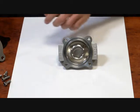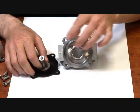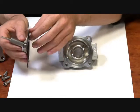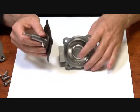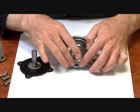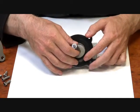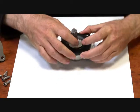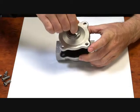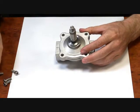If you're putting it back together, make sure you put the spring into the top of the armature, and make sure this body o-ring here sits around this seat before your diaphragm goes on. The diaphragm forms part of the gasket of this valve, so it helps it seal — you can see it's clamped in place. Slide the top back on and then put your bolts back in.